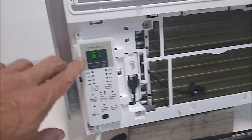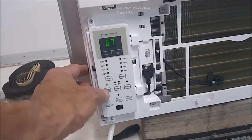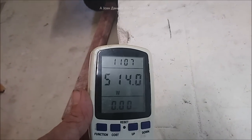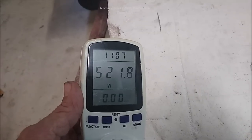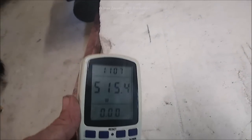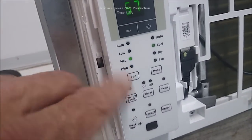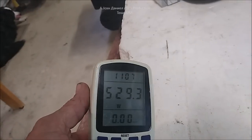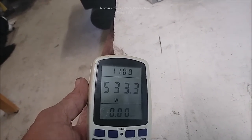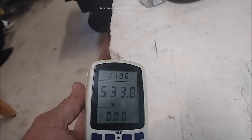I'm going to turn it on here. I've got it preset at 67 degrees — it'll cool in the shop. I'll turn the energy saver off so the compressor cycles fully and you'll see the wattage. The compressor is coming on pretty instant. You see how it's building up slowly — soft start technology. With the compressor running on medium high, going up to high, it's going to run at about 600 watts. Should level out about 550. You see that right there — 533.